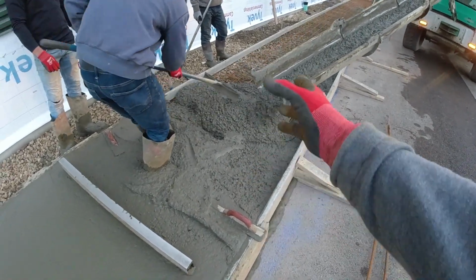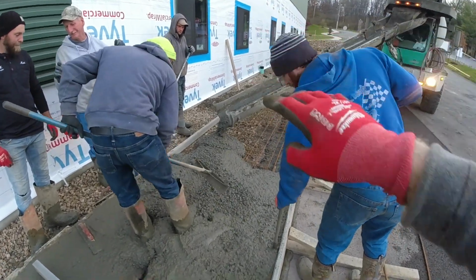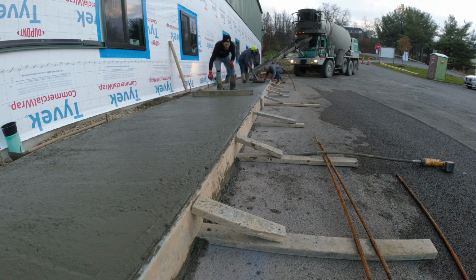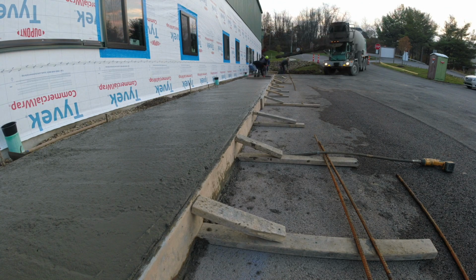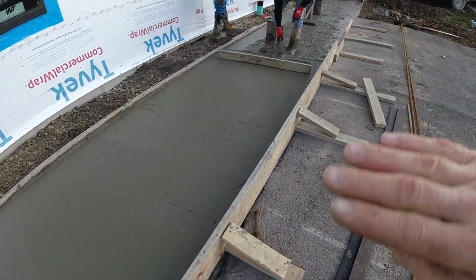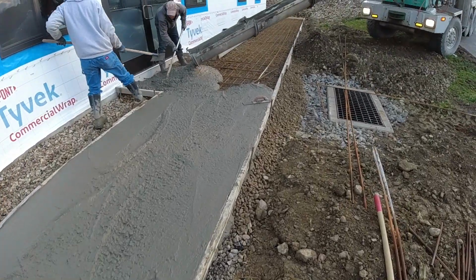The second truck comes right in while concrete's still nice and soft. We do a quick little blend and keep pouring. Getting right at that 2x4, that's where we have to start following our blue line, so it gets a little tricky. Okay, going good. You can see we're following our blue line, tapering it down on the form. Then it levels off. Going good, Matt? Final stretch of sidewalk.